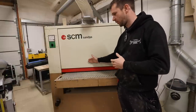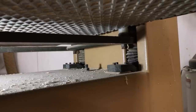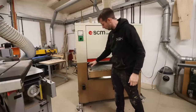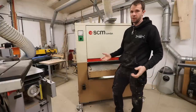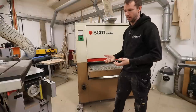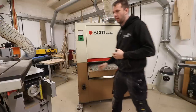I recently made some really wide drawer boxes which couldn't fit through the planer-thicknesser, so I sanded them down with the 40-grit belt, taking probably half a millimeter off in some passes on 400mm-wide oak — feeding it in diagonally across the grain tends to cut a lot better. The rise and fall is on four acme screws connected underneath with a drive chain, so you get a nice parallel rise and fall. Many wide belt sanders also have an auto-sensing pad that automatically sets the bed height to the workpiece.